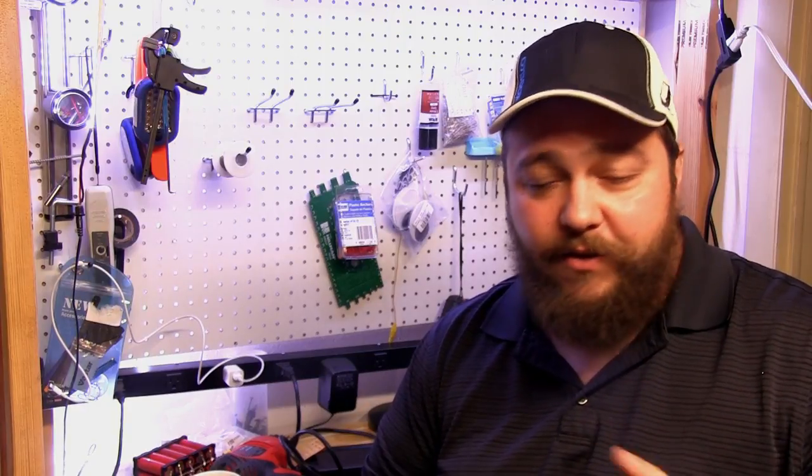So what I'm going to do is make some modifications to the design. I'm going to add an additional relay in with maybe a buzzer or an LED or something that's going to allow us, if we start hitting over that 20 volts, to shut off the relay to prevent us from overcharging the batteries or dumping too much power into the circuit. That way we'll have an audible alert, and a visual alert that'll tell us, hey, you've got to back it down, you've got to change gears, you've got to do something.